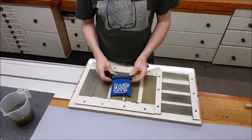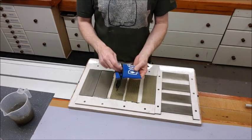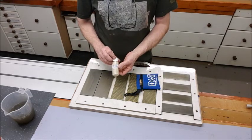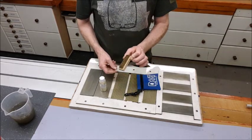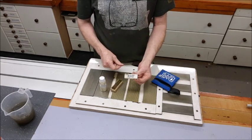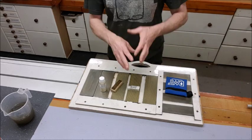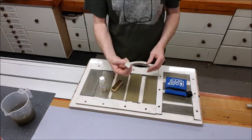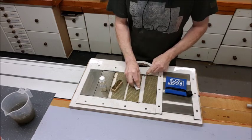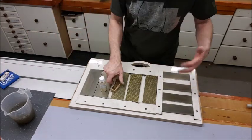So you need to be able to bring them back. I like this — it's a DMT box that you buy. It's especially designed and we've got cleaning powder, a brass wire brush, and a rubber. The rubber is for on-the-spot, instantaneous maintenance: you just rub it along and it'll get rid of certain marks, but it doesn't restore the stone — it's for routine maintenance.